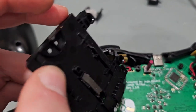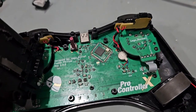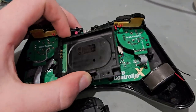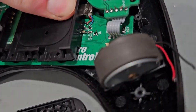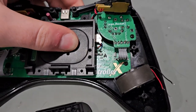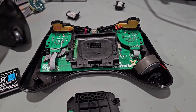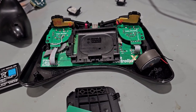You have to do a bit of modification with the battery tray here — it has to be modified so it can fit over top of the MCU and a couple other components like a capacitor. But basically it folds right back in place and hits all the posts. The rumble I added is just that little motor down there — the battery tray holds one side of it and the other side is held with a rubber piece, and it gives you decent rumble. I kept the rumble in this place so it would have the same weight and feel of a Wii U Pro Controller. That's Pro Controller X — it's my perfect controller now. I don't think I'm really going to be using any other controller. Thanks for watching, and good luck to all the other contestants.